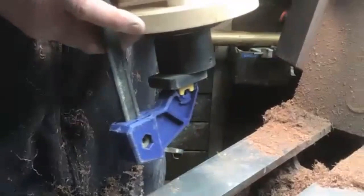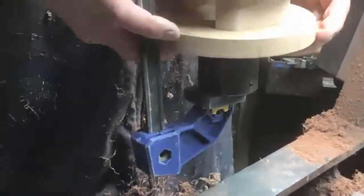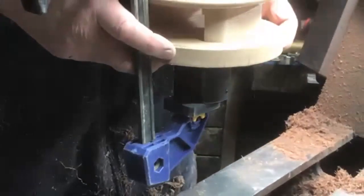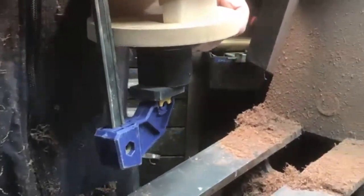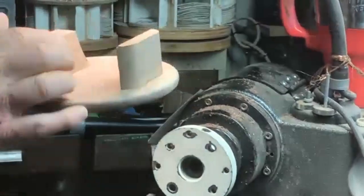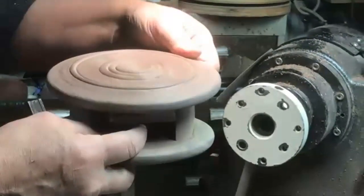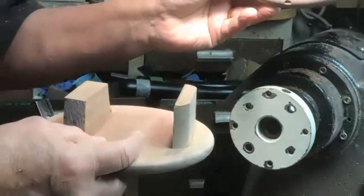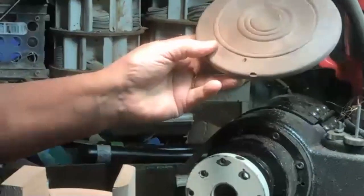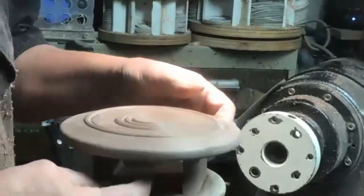Do not hold anywhere that you're going to cut your fingers - stay in the back. Just lay it flat on the table and go slow; there's not a whole lot of resistance. The only thing you don't want to do is put a fence up and try to roll it into the blade. You can barely see there's a pencil line around the bottom. Here's my second piece of scrap wood put on top - this one actually has a wormhole in it, but so what - it's just a little character.